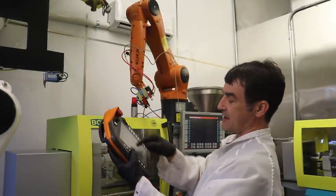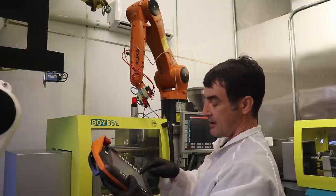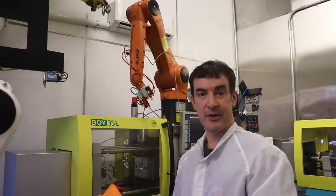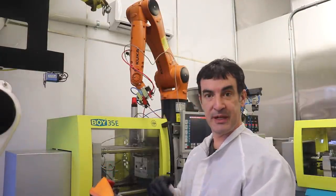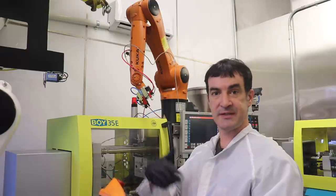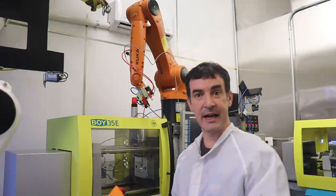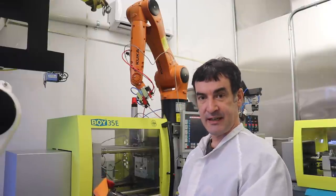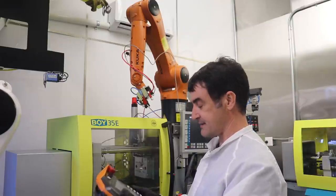And interleaved within these points of location are other things, like turn on output one, or wait for 2 seconds. Or you can also put a loop in, so this program just runs constantly over and over again, which is how we're going to run it. And that's usually how I run automation. And there's also statements like if-then statements. So that is a nutshell of programming these robots.